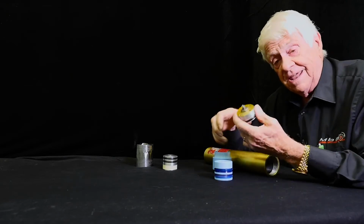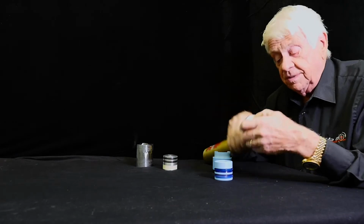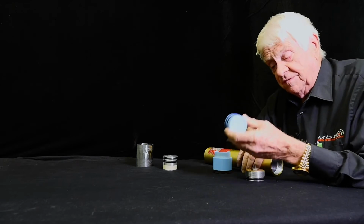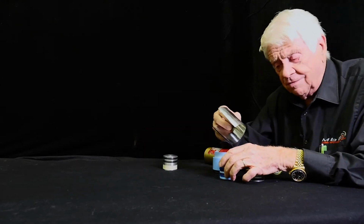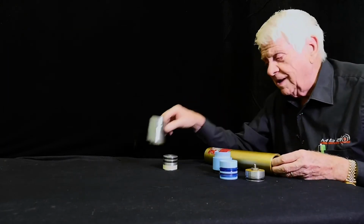This is the nitrogen end of the cylinder. It has an O-ring on it and a backup ring. That just basically does up the accumulator like that. So to fit this piston, we used to use a piece of shim stock like that and wrap it around to compress the lips. It didn't work all that well.